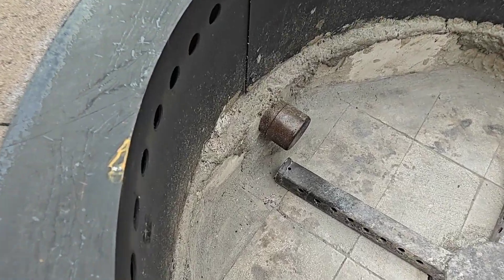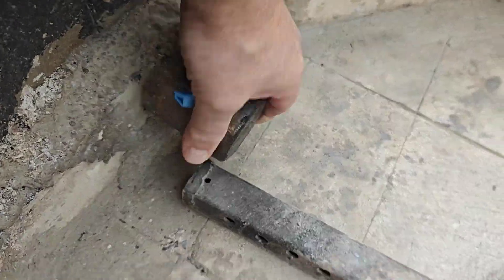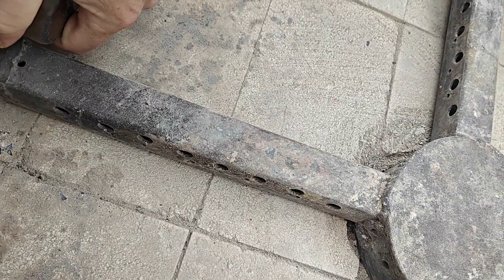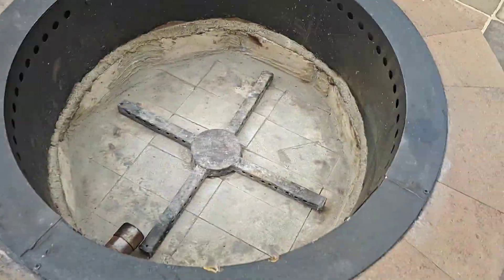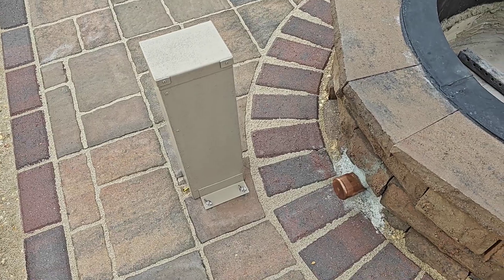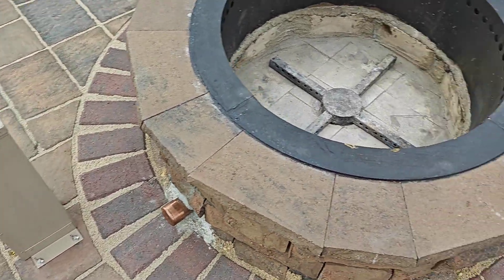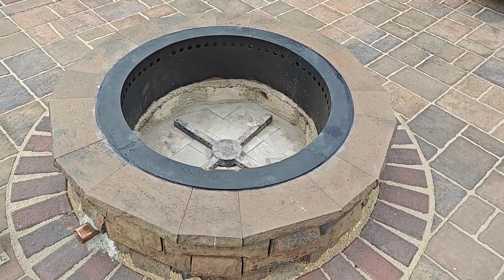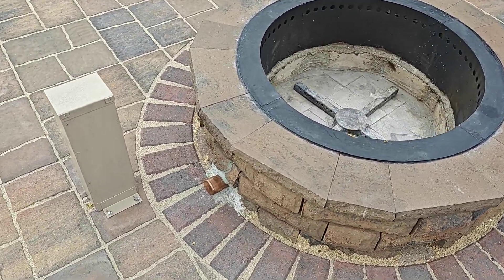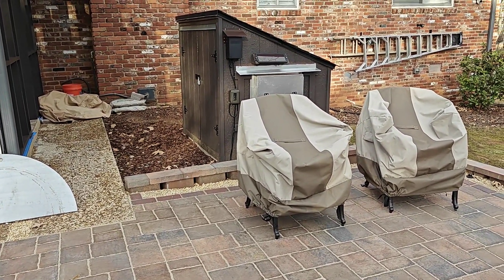This little pipe right here, which I've covered in another video — I can take the end off of it and run a natural gas pipe. We have a two-foot portable fire pit that I can set in here. If I don't want to burn wood, I run a gas line out underneath the cover; I have a gas line with a quick disconnect and a valve. So if I just don't have time and I want a quick half hour fire, I can put our portable two-foot pit in here, hook it up to natural gas, and use it that way. I've not seen anybody else do that and I think it was a great idea. I was building this patio anyway, so I might as well run the natural gas line under it and tie it in. I also tied that into my generator shed, which was convenient — that way the inlet for my generators is inside the generator shed.